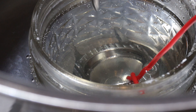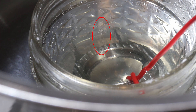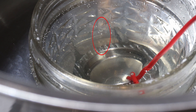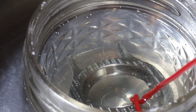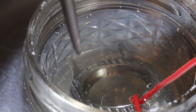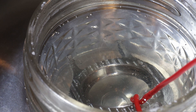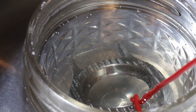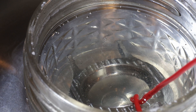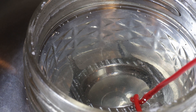If you look right down there you can see a stream of bubbles coming up — that stream of bubbles is the alum slowly dissolving the tap. It's been about an hour and a half, and if you look down there you can see that the bubbles are a lot more energetic than they were earlier, which is a sign that it's gotten farther down into the hole and it's doing a really good job of dissolving the tap.